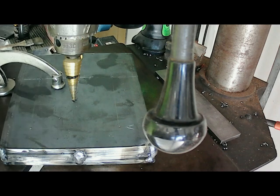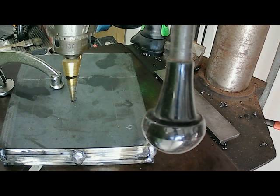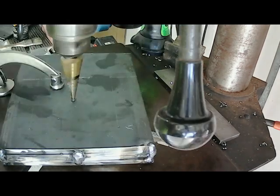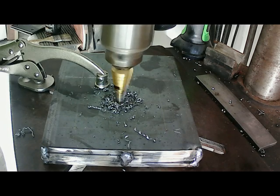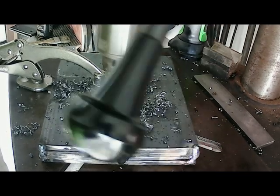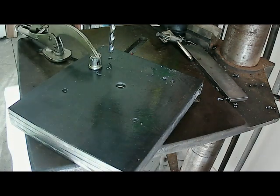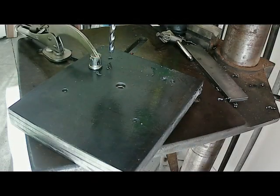After that I'm going to break these corners off where the weld is, and then they'll be all one piece and I should be ready to start some assembly. I got all the step drilling done for all four riser plates. Now I've got a quarter-inch diameter drill that I'm going to drill through all four holes, then move up to the half-inch drill and finish the center hole and the five holes in the base plate.